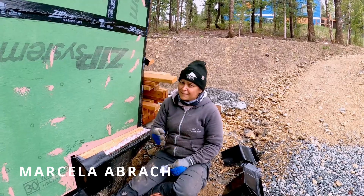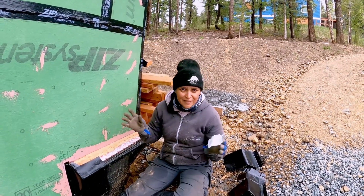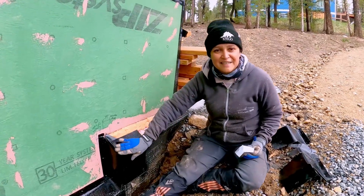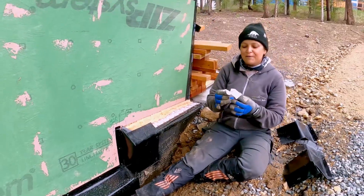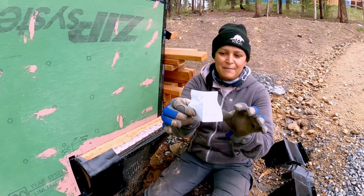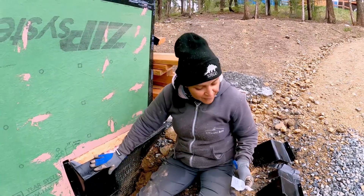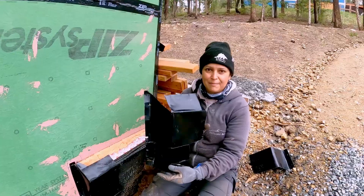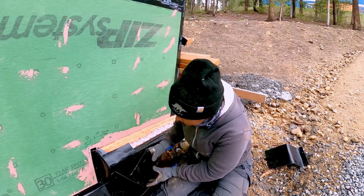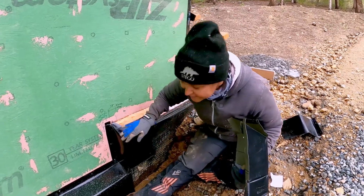Related to what you see down here — let's talk metal flashing. Anyone that knows me well enough knows that I'm terrible with geometry and spatial awareness, so having to create details like this one is pretty challenging. What I did — if you have the same problems — I did my little mock-up on paper, so I have all the flaps and I know what needs to go under and what needs to go over. After having that template, I created an actual template with a piece of metal flashing, and as you can see it took me several tries to get it right.